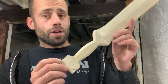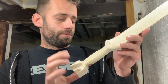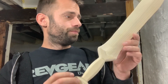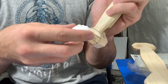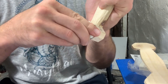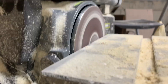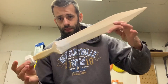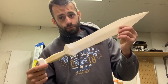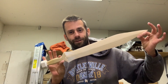I think I'm gonna try just casting it with the handle and everything on there, rather than peening on wood. I'm gonna attempt to cast a pommel on there, so I'm just gonna take some Sculpey clay, jam it on the wood, and roast it over a burner to harden it. So I have the blade roughly cut out. I think this will work for a pattern. I'm hoping it will. It's already getting fun.